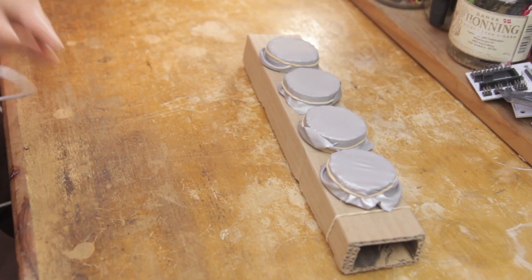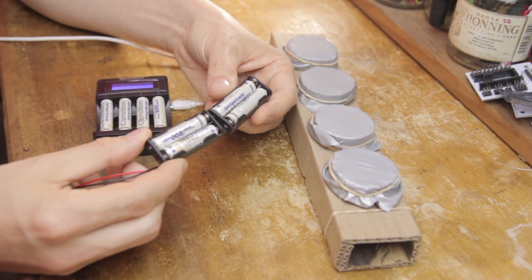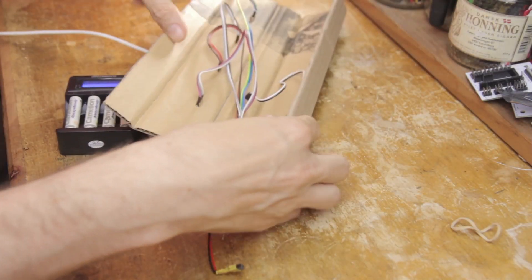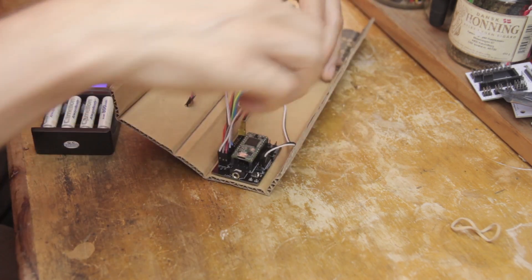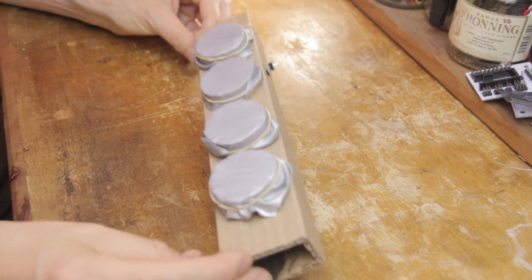So that just leaves the onboard power. I've opted for a really simple setup where the microcontroller can be powered either with USB or with batteries, and there's a simple diode circuit that protects everything from overload if you plug in both things at the same time or the wrong way around. I recommend four rechargeable NiMH, or nickel metal hydride, batteries as a power source. The Teensy is quite flexible as far as voltages go, so old-school alkaline cells will do the job as well, and even a one-cell lithium polymer or LiPo battery can work. The reason I like NiMH cells is because alkalines have a tendency to change voltage quite dramatically as they discharge, while LiPo batteries famously can catch on fire if you overcharge or over-discharge them. NiMH batteries are stable and safe, and they provide plenty of power for hours of use — so to me that's just a no-brainer.